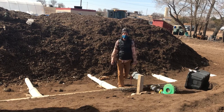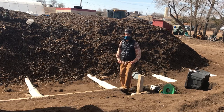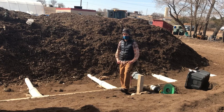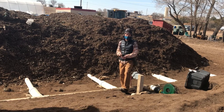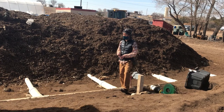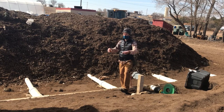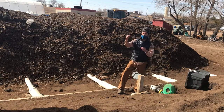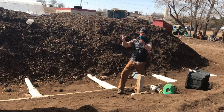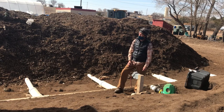What's the advantage of doing this in the first month versus just turning it from the get-go? Some of the advantages are space — we have limited space out here to effectively move all this material — and also labor and machinery. If you've got access to two loaders and enough labor, you might just choose to do traditional windrow style composting. That windrow style really comes into play in our second phase when the material is cooling.